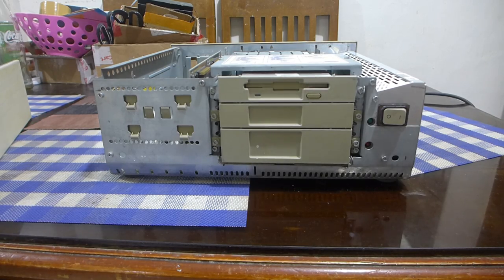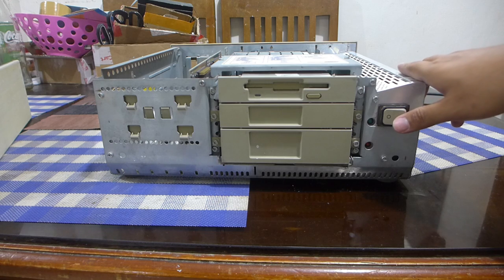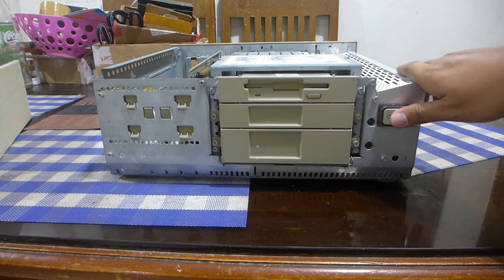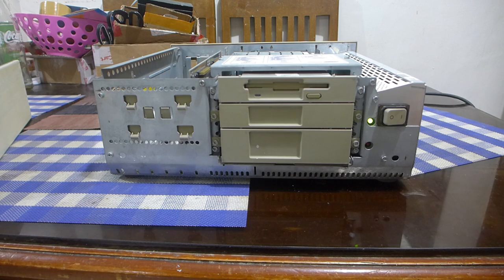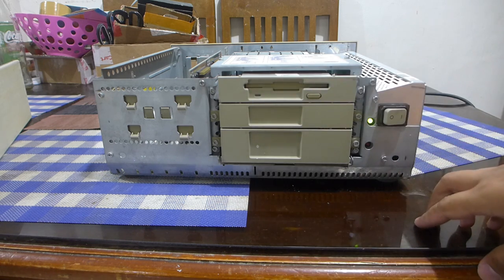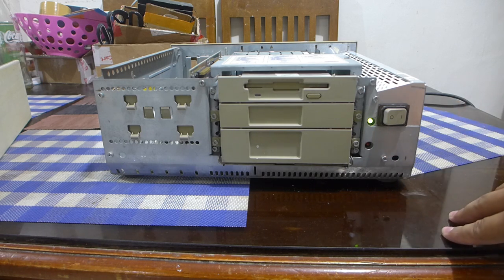Okay, I think this thing is all set up now, so I guess there's no other thing to do other than to flip the power switch. So here it goes. I hear a hard drive spin up. Should get a floppy seek and then a beep code about floppy drive error. Oh, keyboard error. Yep, we got floppy. And it attempts booting. Hard drive activity light's not working.